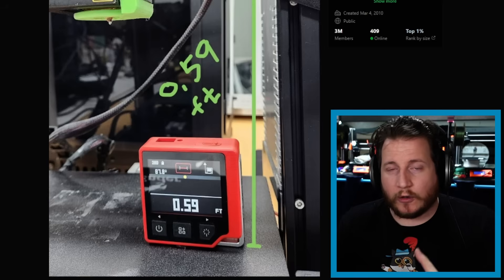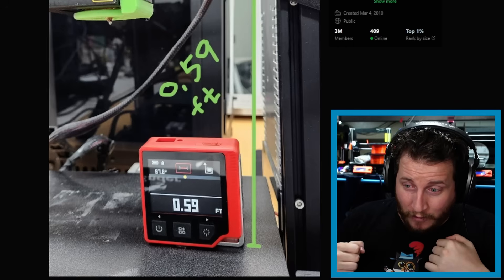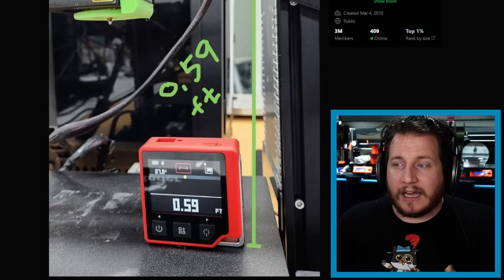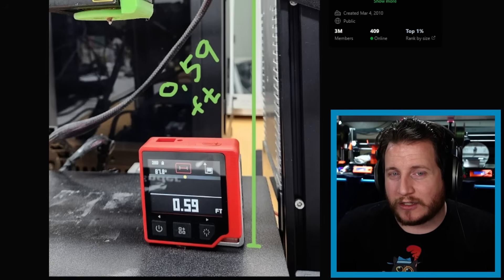Getting your first layer right is all about how far your nozzle is away from the actual build plate. We did a video on this where we looked at my buddy Chuck's Helibux E Leveler, which makes leveling machines like this very simple — much faster than doing it with paper and more reliably too. If you want to level or tram your machine — which is leveling to itself — don't use angle finders or plumb gauges. You're looking at the axes and squaring them to each other, not to the earth. You can mount printers on their sides, or even on the ceiling.